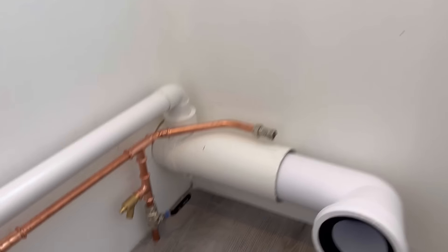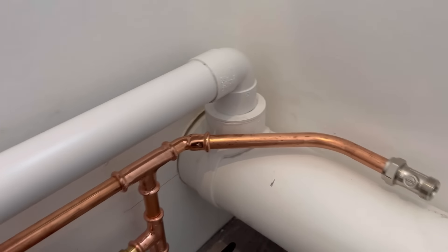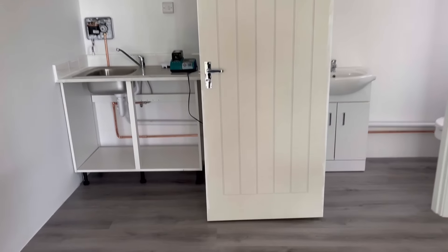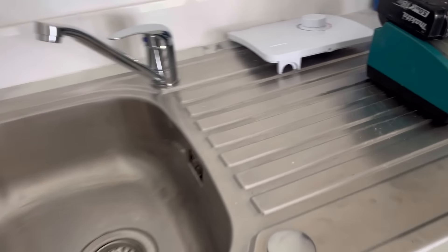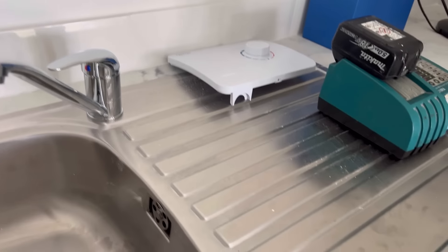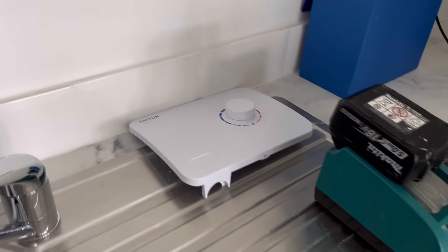I'll show you where we're up to in here - toilet's not in yet, I've already marked up on the floor where it's going. We've got our lever valve stop tap there, straight into a drain off - just need to tighten it up. Obviously teed off for the basin and the sink, and this will be the tee off for the toilet. So the toilet is back in, fixed down, done. I'll probably just run a bead of clear sealant around the floor pan, around the toilet and around the basin. What I did with the overflow - I just put a board washer on so it will actually work, but it obviously doesn't look very nice. I'm going to leave it to the customer to try and source a new one, then we'll be back to swap it.